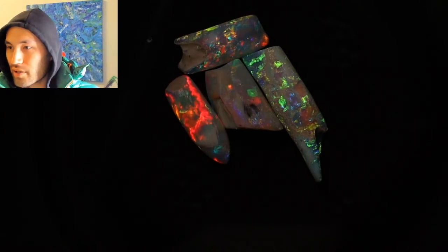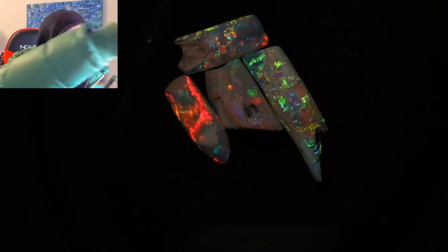Let's have a look at what we're doing. Step one — I'll show you what I do with my cerium oxide. I've been very careful not to disturb it. I've got a 250ml container, about one cup. All I've done is add a teaspoon of cerium oxide powder — the Super Serum that I sell. It's a better grade, better quality than optical grade — much smaller, much cleaner — and basically all you do is add a teaspoon to a cup of water.